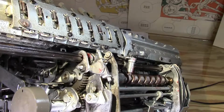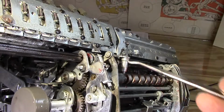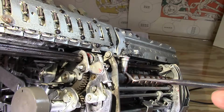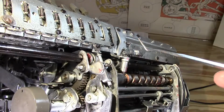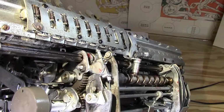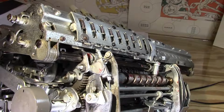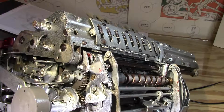And then when it approaches that permanent tab stop location, it gets lifted up a little bit. Actually, it isn't so much lift as it gets cocked or rotated. Okay, now it's set. Now I'll go back with the clear everything button, and it will be deployed up, and then it pops up. Now it's going to go back to this permanent carriage or tab stop location. Gets really more cocked over than anything. There we go. And then gets deployed back down again.